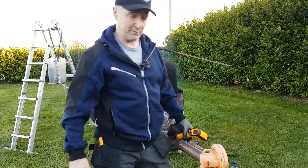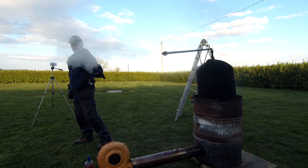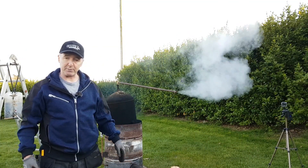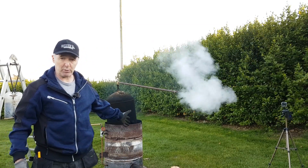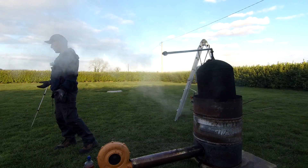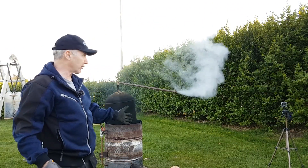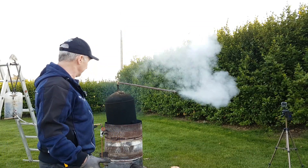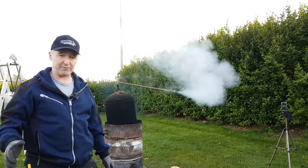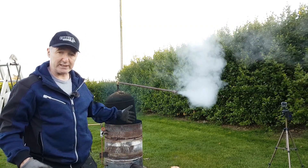Still making a ton of heat. This copper cylinder is rated at 40 psi and we have an open vented system so we're not making anywhere near 40 psi. At the moment I'm safe enough to be here and we're doing that with waste oil, using a very rudimentary basic burner — and you can see it's going really well. No question as to whether we're making 100 degrees C. I'm not going to leave this going for much longer now. At this point this is not safe. So there you go — very basic waste oil burner, very basic waste oil water heater.